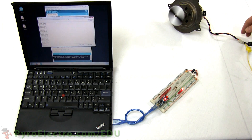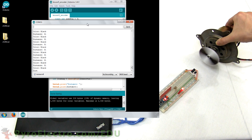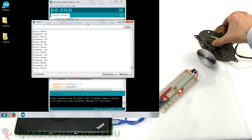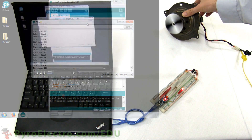A common application for this type of encoder is on motors to keep track of how far they have moved and how fast they are going. Here I put the encoder wheel on a motor that is spinning quite fast, and when I bring the motor into range of the sensor, you can see the LEDs move continuously and the distance output on the serial monitor increases dramatically. This type of feedback sensor can be used to create very accurate movement in systems that run motors, from turrets on tanks to wheels on robots.